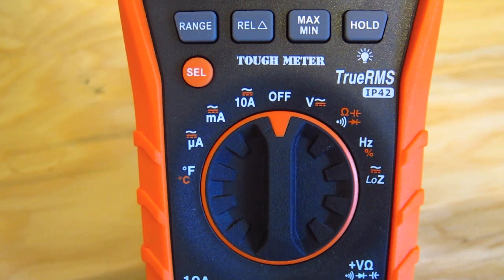I've used multimeters in the past to even check whether or not my son's alternator on his car was working, because it's really simple to do. You just have to make sure it's putting out more than 12 volts — around 14 volts — to be able to charge the battery. There are just many, many things you can use this tool on. I really like this one because it's very durable. I like the auto-ranging function because that means I don't have to try to guess what the voltage might be of something.